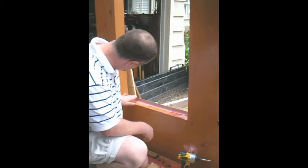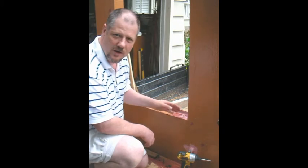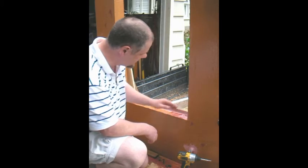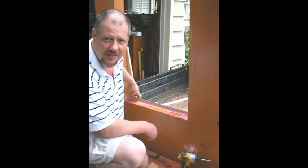All I'm going to do now is do a little bit of fast flash, and then later on I'll seal the back of the window frame to the front face of this sill to provide the seal at the bottom, and then the window actually gets screwed in at this location.